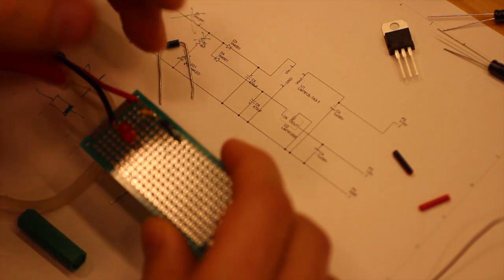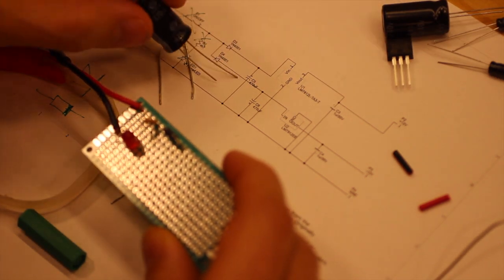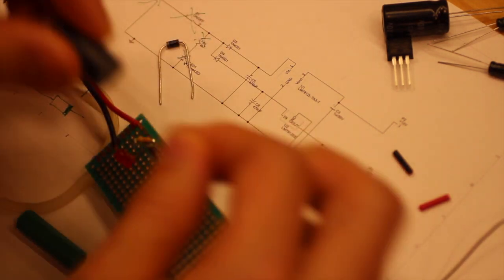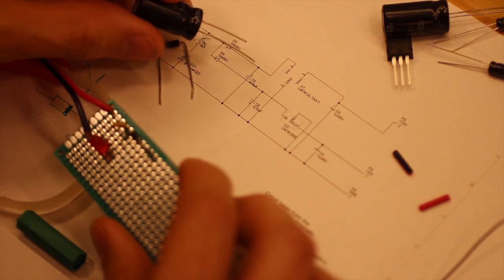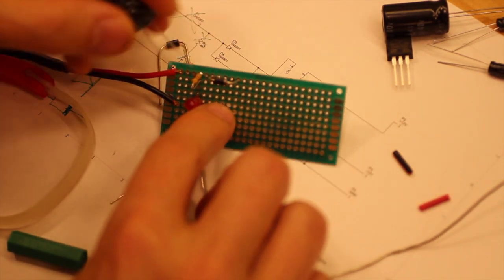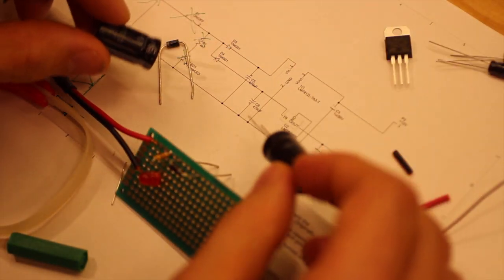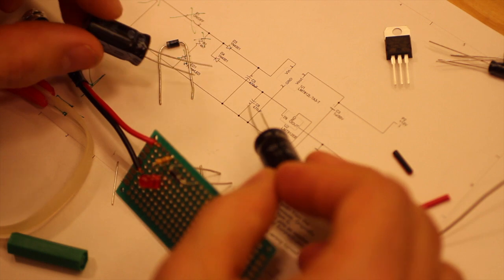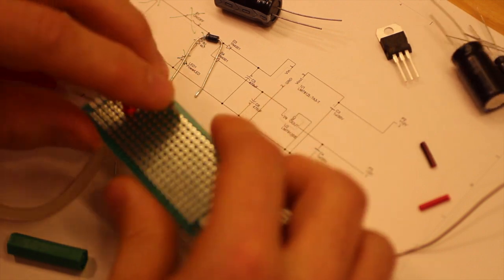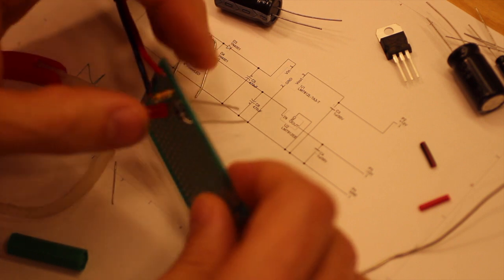And now it's important to see what's happening here, because the next part is the capacitor, these large ones. So there should be one between, there's supposed to be one from the end of this diode to ground, and then from the other one on the other diode to ground. And that will be the plus and negative sides of the rail.